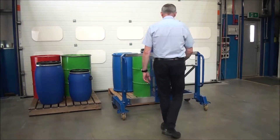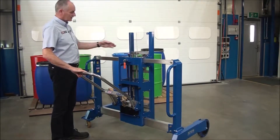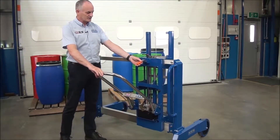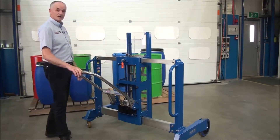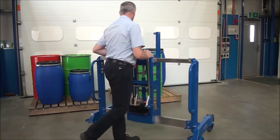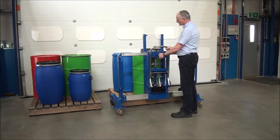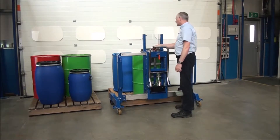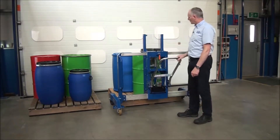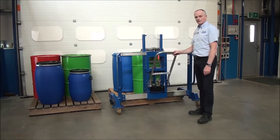So let's start off here. You've got this pump assembly and we can pump the handle to raise the grip at the top. We turn this to lower, and we can also side shift to any position. Let's take off the first drum — they're full of water so they weigh about 218 kilos each. Wheel over to the pallet; the wheels go down the side. You can adjust the centre point for the grip. We watch the catch through the guard, lower down so it connects on, and then pump the handle. It's so easy to use considering that drum weighs about 218 kilos.